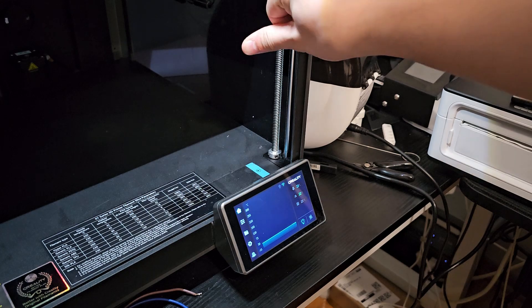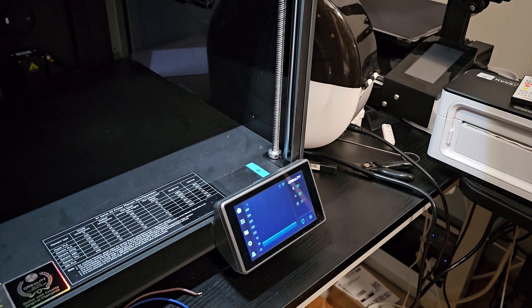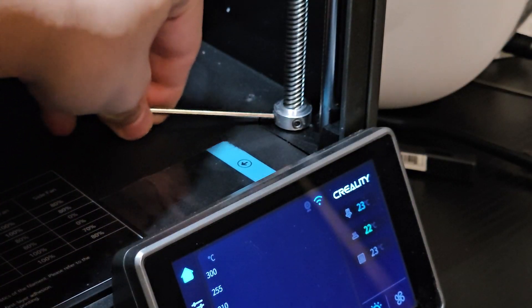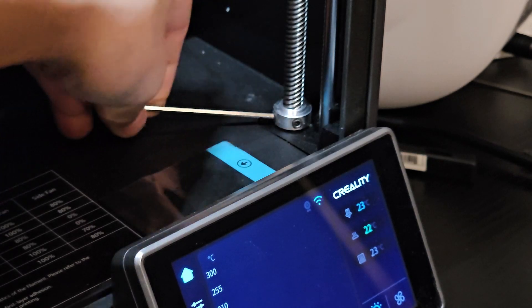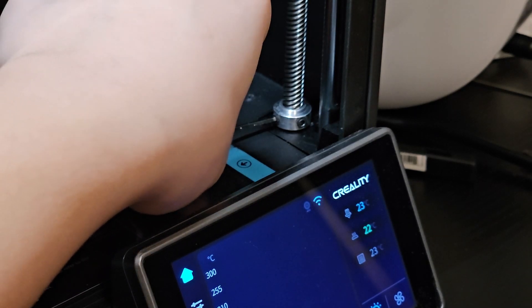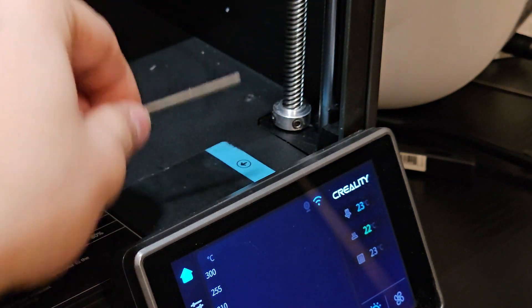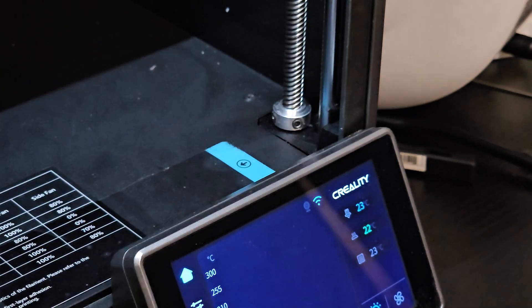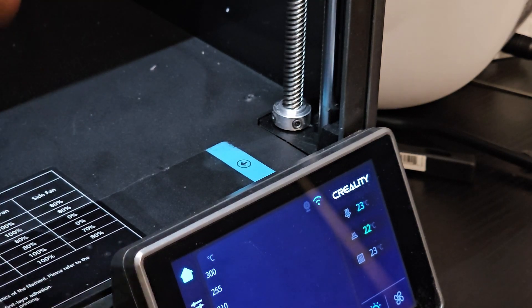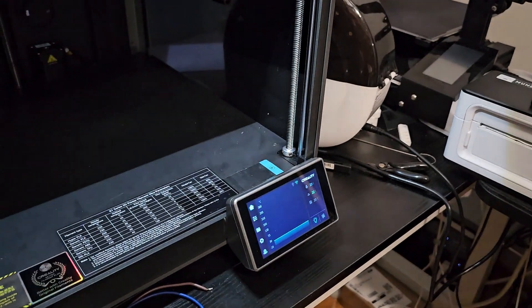With this method you don't have to do any of that. In other videos when they twist the lead screw there's a clunking sound — that's one tooth skip. With this method you just put your Allen wrench in and twist whichever way you want. Twist to the right and it goes down; twist to the left and it goes up. Keep twisting until you hear a clunking noise. I've been doing this for a whole day and got my bed leveled pretty nicely — I don't want to redo it because I'd have to calibrate all over again.